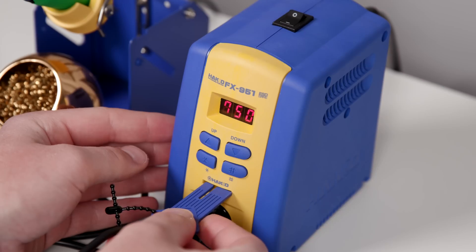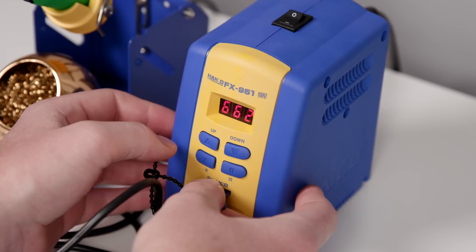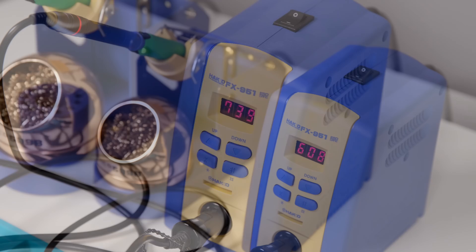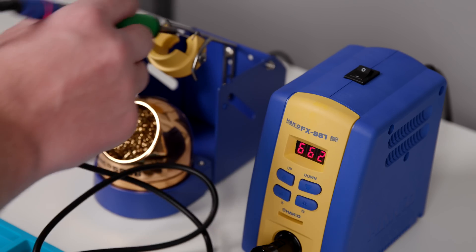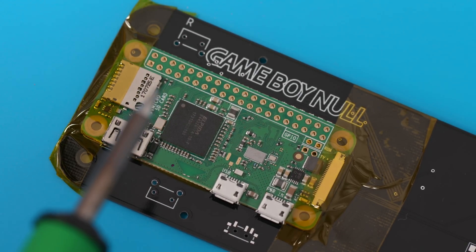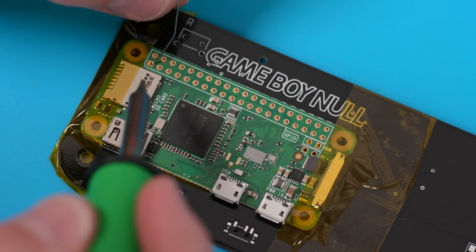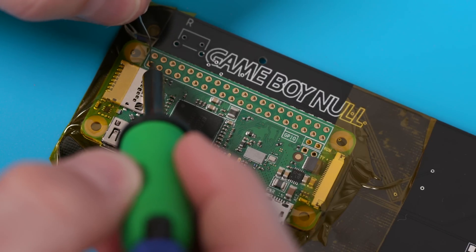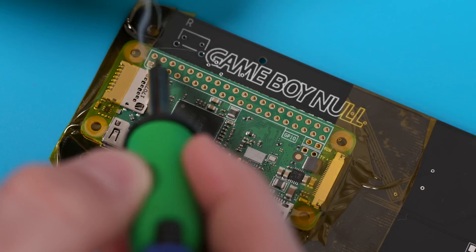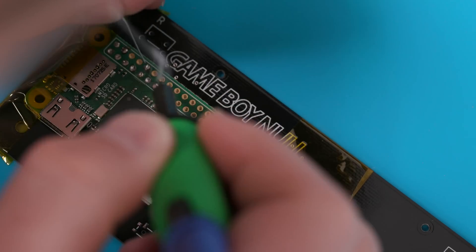Okay, that was the easy part. Now it's time to heat up your soldering iron to about 350 degrees Celsius. If you have a cheaper soldering iron that isn't adjustable, that's fine — just make sure it's rated to get hot enough to melt the solder. I'd recommend taping your Raspberry Pi down to the back of the board just to make sure it doesn't wiggle around while you're soldering. Then start soldering the Pi to the board pads — you basically just stick the solder down inside each of the little holes, and let the iron fill the cavity with melted solder. You can push the tip of the soldering iron down inside the hole to make sure the solder creates a good connection.